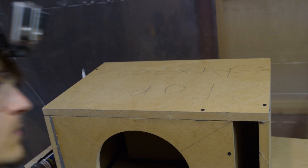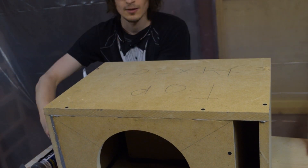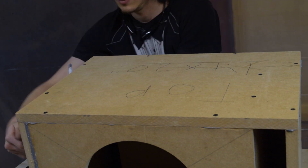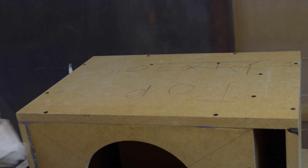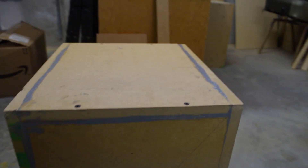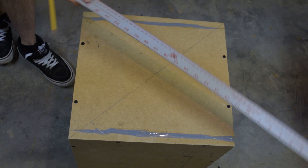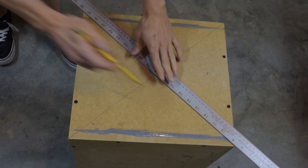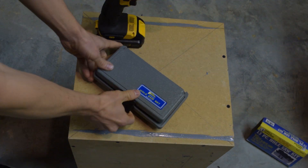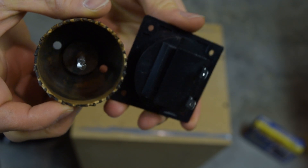I'll place the top on while making sure it is lined up and drill and screw it together just like the bottom. You probably don't need to use the screws for the port walls on the top and bottom since it's sandwiched in between, but I like to do it anyways just in case. I'll smooth it out and wipe off any extra sealant or glue. On the non-port side I'll find the center point again by drawing an X — you can put the terminal cup anywhere you want besides the port, just make sure it will not interfere with the subwoofer. In this hole saw kit I'll find the one that best matches the terminal cup and start drilling.